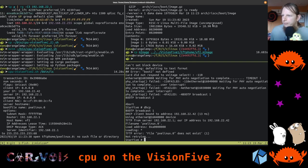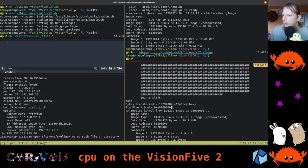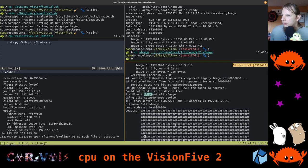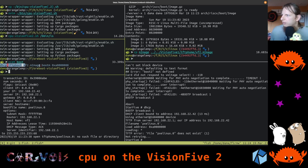So first we DHCP, then we say, let's actually write this down here. Let's take some notes. Boot, let's call it boot. So we need the TFTP boot command, which we got here. So this here, then we say, what do we say? Oh, actually, let's go with this. So first we DHCP, then we TFTP boot, and then we say bootm and this address, right? So this is bootm, this address, yeah. Marvelous. So this is the command we actually need to run.